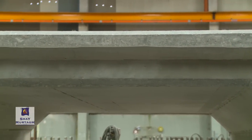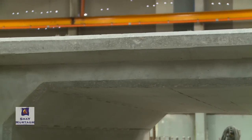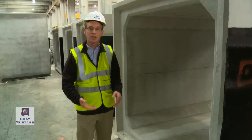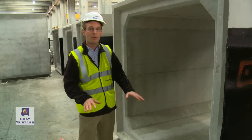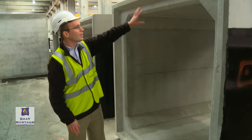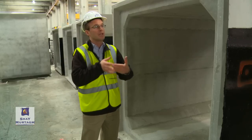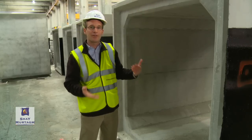The other benefit of having a joint is that when the culverts are actually laid in the ground, you're never going to have a perfect formation condition. There's always the potential for differential settlement of the material below the base slab of the box culverts. Having a joint that allows for rotation every couple of meters essentially minimizes or eliminates the negative effects of that differential settlement.